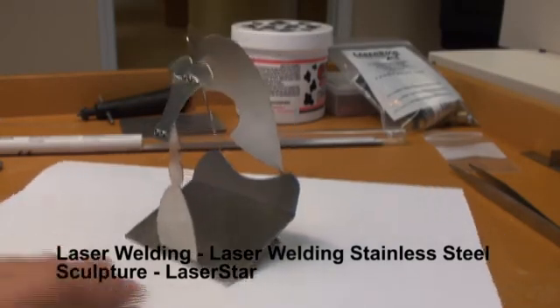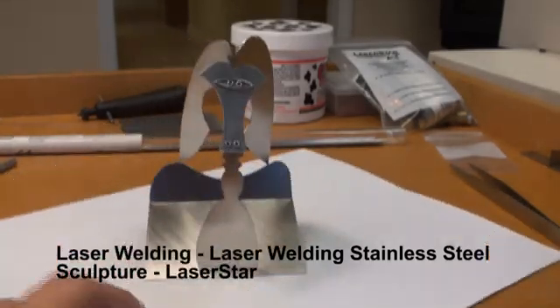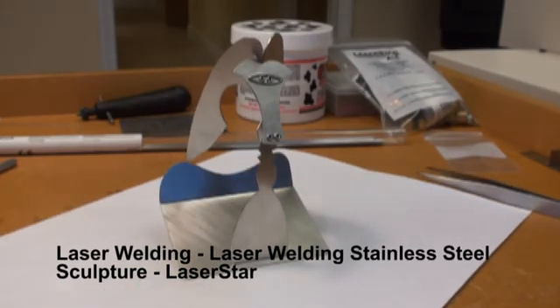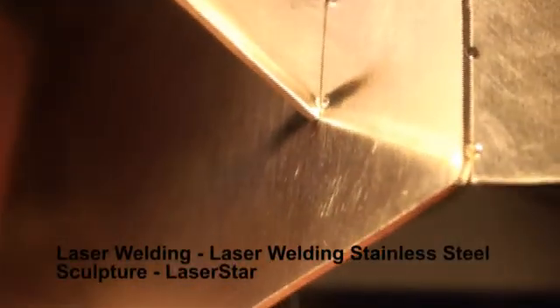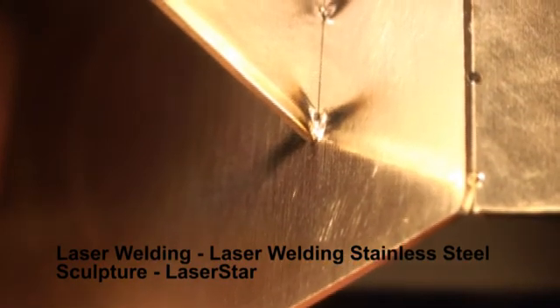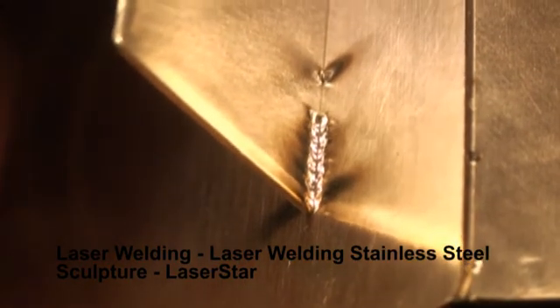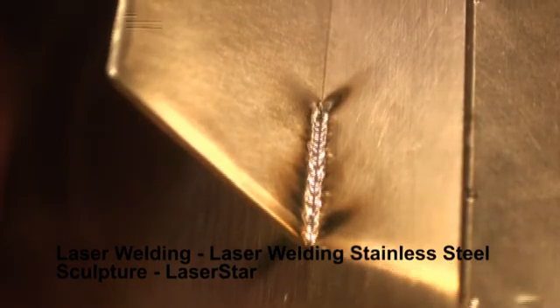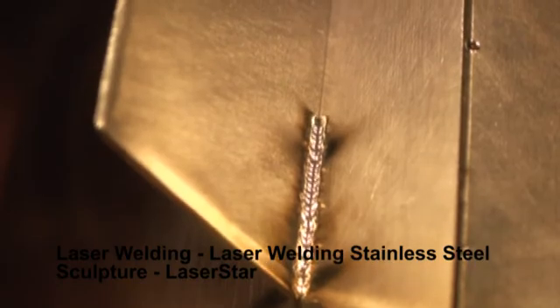Here's the part all tacked together — it's only tacked right now. Now we're going to go inside and weld all those pieces together so it's nice and sturdy. We're back, and I've put a few more tacks on the sculpture to keep it in place. We're going to start core welding now. What I'm doing here is running a welding bead where I want this to be permanent, and I'm going to do this in all the areas where the sculpture is touching.